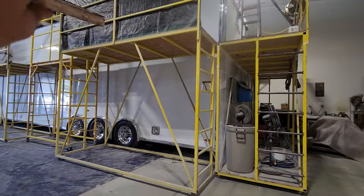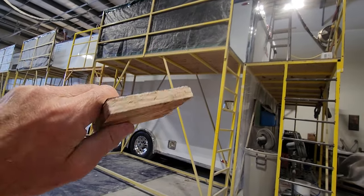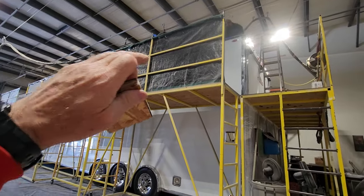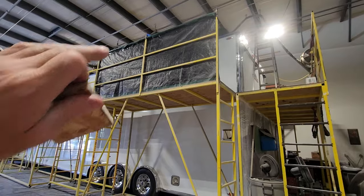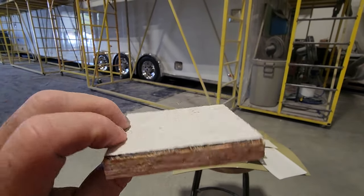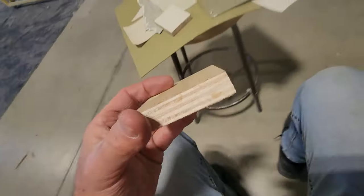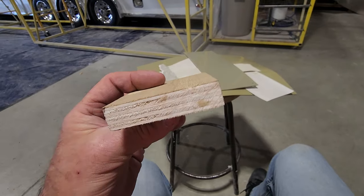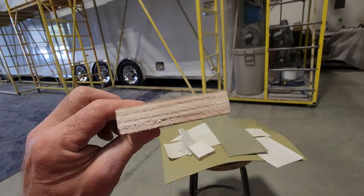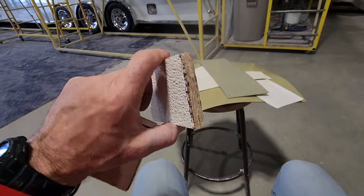I had Dean help when we took the roof off the stacker. Why are we changing the roof? Originally it was half-inch OSB — like particle board, very prone to soaking up water. Plus we've added an observation tower on top with an awning so we can watch the races. The original fiberglass roof was prone to cracking and leaking with a 10-to-15-year lifespan. This is what we replaced it with: nine-layer marine grade Okoume plywood. They make boats out of this. I've seen tests where it's left outside for 30 years and still doesn't delaminate — and submerged underwater for three years without falling apart. The OSB will fall apart overnight if put in water.